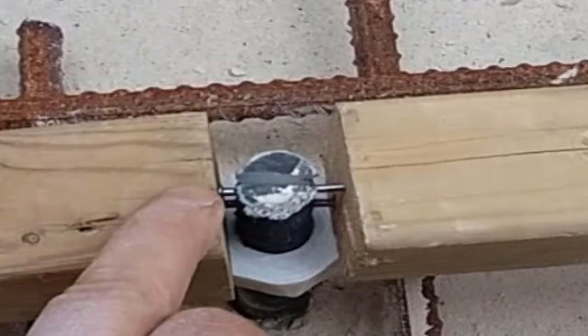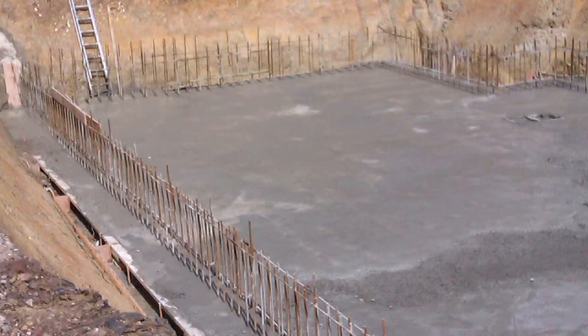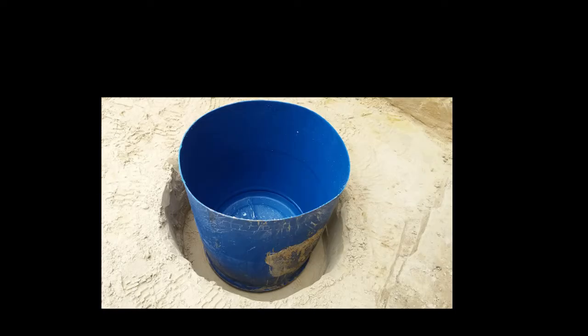Using short lengths of 2x2 and 40mm nails means that the nails can be resined into slots and the 2x2 yanked out from the edge of the finished concrete. The 2x2 void can be filled after the slab goes stiff, and everything left behind will be buried and hidden.